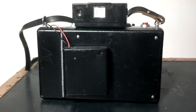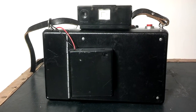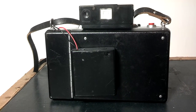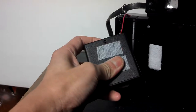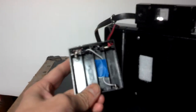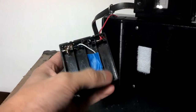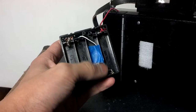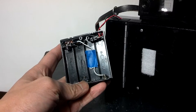The way to rig the holder to be able to take three batteries instead of four — because if you do four batteries, it's going to overpower the actual camera sensor — is you need to connect the positive to the negative. All I did was just cut a piece of wire and attached it from here and then put it over there, so that you actually have access to using only three batteries instead of four.